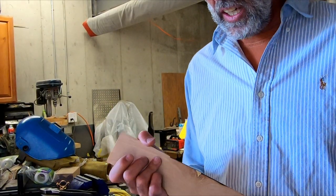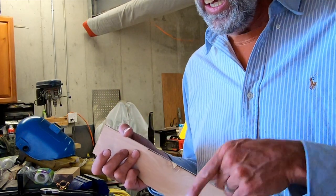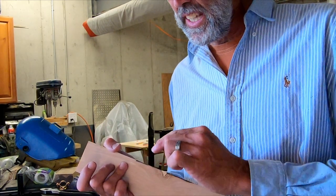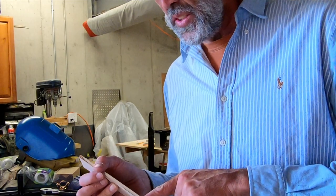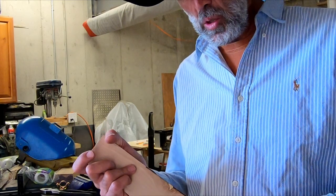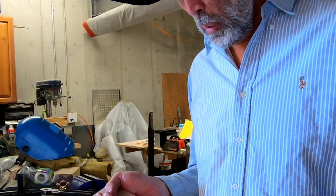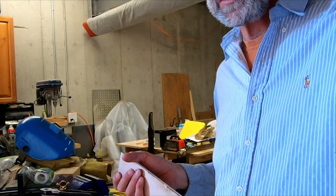I just wanted to see, using wood as a template — people probably wonder with all that heat, is wood an issue. This is the underneath side. We cut right along here with the tip pointing down, and all there is is this little bit of charring. It's not even coming off on my finger. Wood templates are a good way to go with plasma cutting. I'm excited.